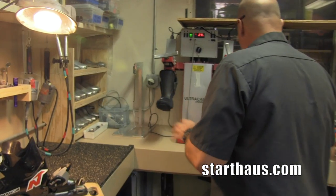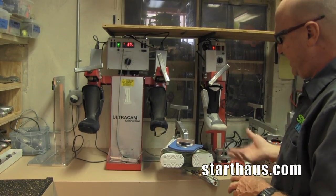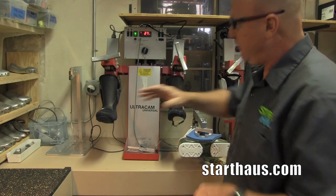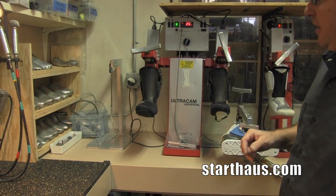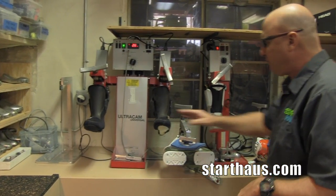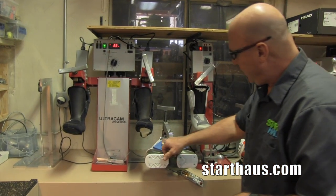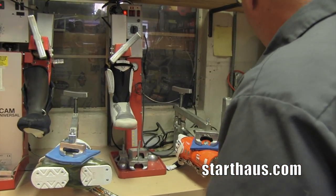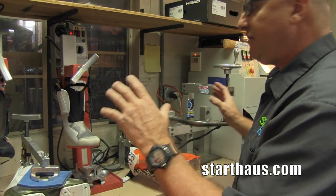Over here it's become really important to have machinery that can heat internally, so these are internal heat stretching machines called ultra cams. Back in the corner you can see a lot of the different dies and shapes for the ultra cams that are set up to make different punches. Right now I'm stretching a couple of liners — increasing room in the toe on a few, with a navicular punch going on this one and an ankle punch going on here.